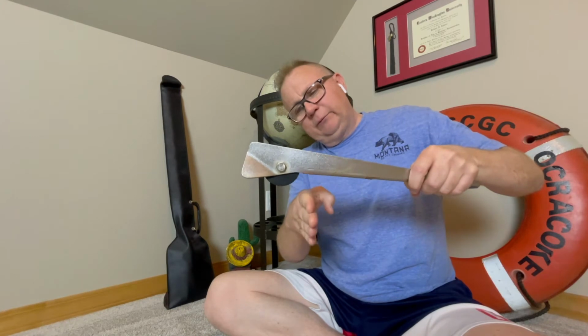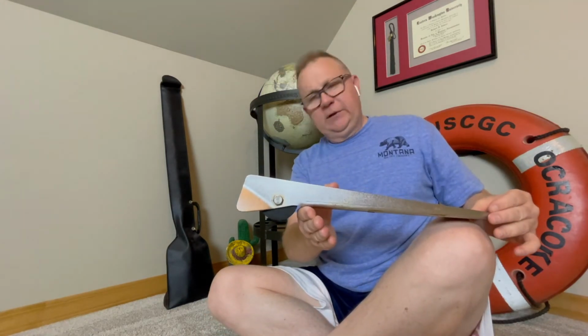And the other problem is that from the end of the bowsprit, which would be right here, your standoff distance to here is only an inch or two. On my boat, the fluke will contact the bowsprit and do damage to the bowsprit. And then the other issue is this thing was mounted on the port side of the bowsprit, and I have a windlass, a 12-volt electric windlass to the starboard side of the bowsprit. So really I need one with a bail and one with greater standoff distance for the modern anchor, and I need it to be on the starboard side.